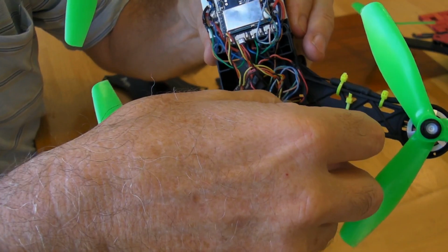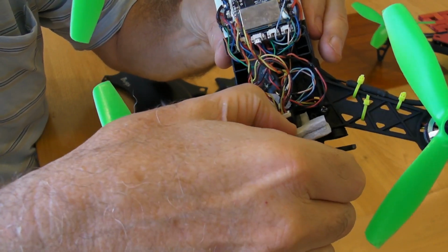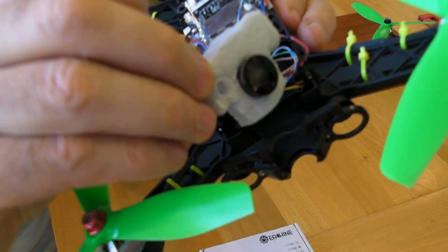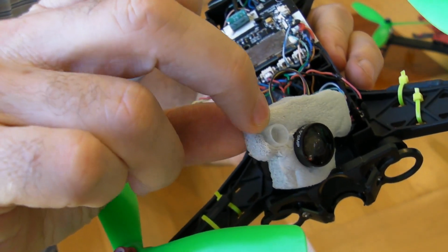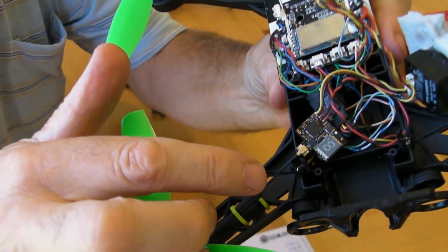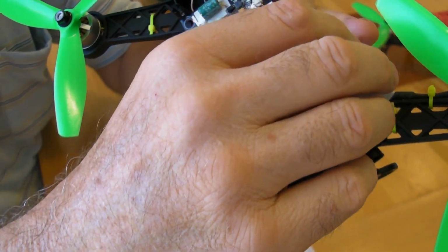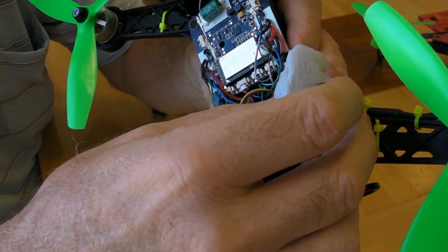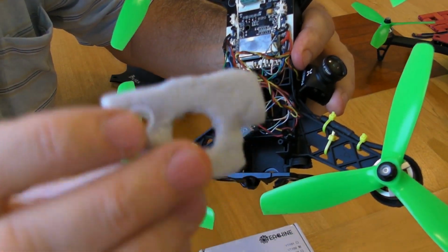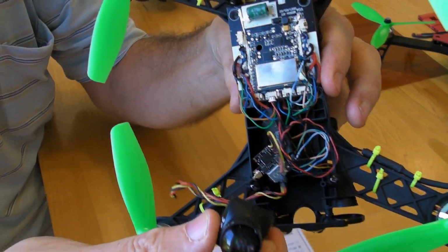Razer Mini. And the way I've mounted that, I've put it in a block of foam, and with that block of foam I've put a bit of tube through it on the side there that rams air straight onto the VTX02 behind it. So there's the VTX02 again. Here's the Foxeer. You come out of that foam quite easily, I think. So there's the foam, and there's its little funnel to ventilate the video transmitter, because at 200 milliwatt they get quite hot.